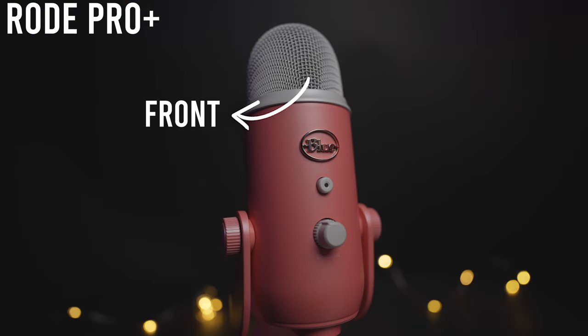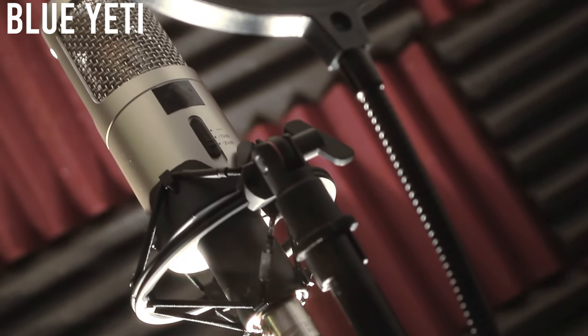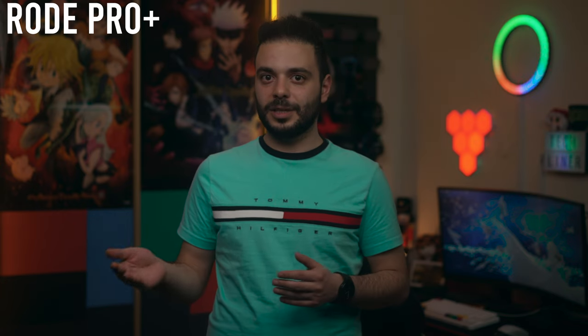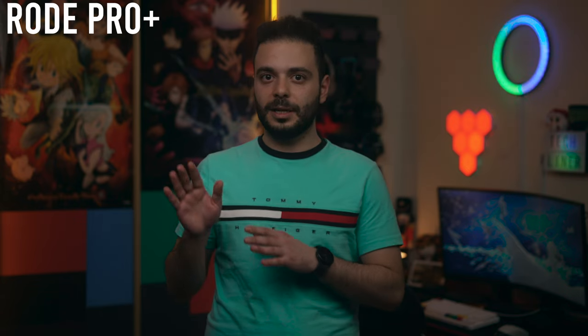Now, as I promised, I'll give you some tips to get the best out of the Blue Yeti. First and most importantly, record from the front side, not from the top — I see a lot of people make that mistake because the mesh top is directed upward. Tip number 2 is using a pop filter, which will improve the highs, especially with the letters T and S. And the last tip is using low gain on the mic and increasing it later in post — I found the results a little bit better than starting with high gain on the mic.